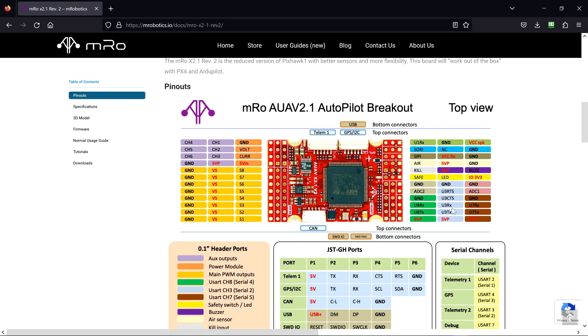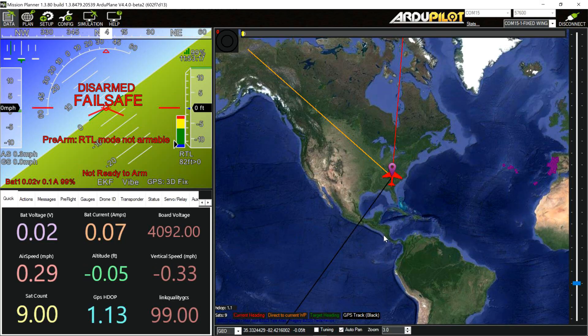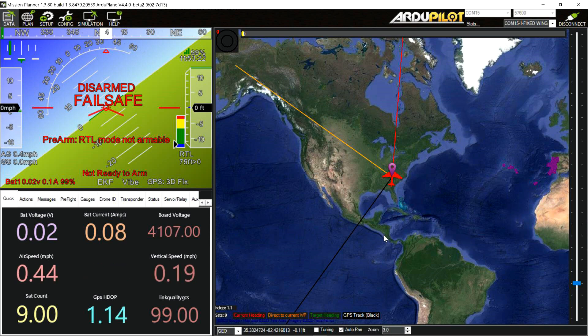But as the CTS/RTS doesn't work, I took those pins out of the custom cable and I picked up ground right here. You can see UART 3 here is serial 2 in ArduPlane. So that's how I wired this flight controller. Here is that plane across the way, connected via a little 433 telemetry radio to the telemetry radio in the bottom of the Nano Talon.